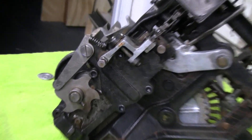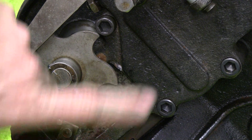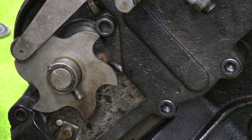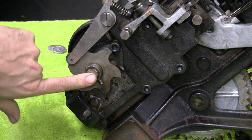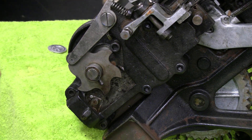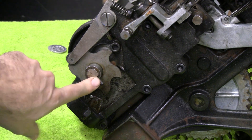Here's where I screwed up and I didn't realize it. I put the pin in — I didn't want to force it all the way through, I just wanted to do a test run — so I put it in halfway. It was pretty hard to get in but I got it in, set it back up, and then I found out that the magazine wasn't lined up right and it wasn't feeding the tokens. After some discussion with an expert — thanks very much Nick for helping me with this — Nick suggested that this pin is actually tapered. It's not just a regular pin; it's slightly conical at one end, and the hole in the spindle is not a straight hole, it's slightly angled and tapered inward. The pin is designed to go in one way only.